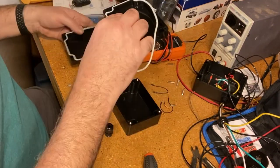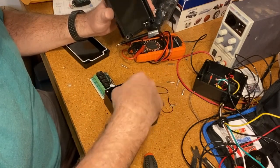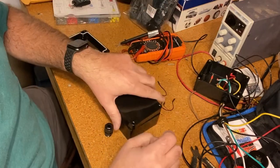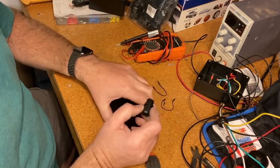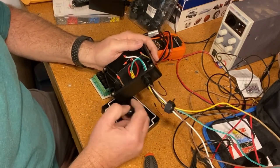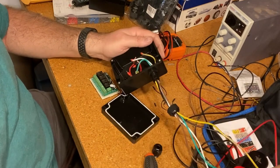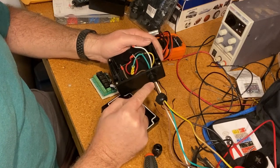Once you're finished with that, you've got to drill a hole. I used a step drill — they're pretty cheap — and basically drilled the hole through here so that I could put my lines through. My system has that plug. It goes through to one of these watertight connections. The way mine is wired, the green is the positive. There is no negative, so I had to run a negative into it because the board does take positive and negative.